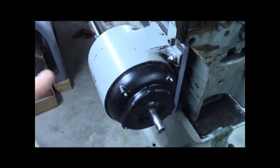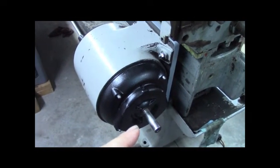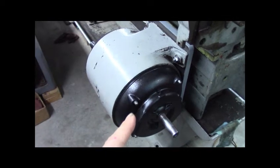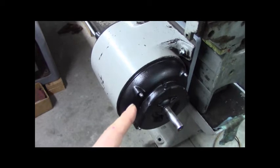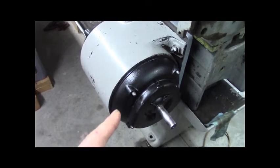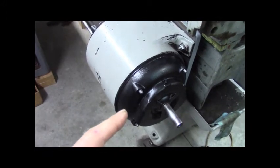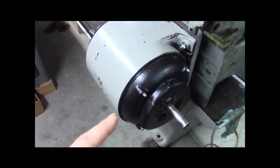What I did to that motor: getting that pulley off was the big one — that was two hours with the cutting torch heating it up. I cleaned the end bells, so much dirt and grease inside. I stripped the layer of gray paint right down to the primer using the needle scaler gun, then cleaned them meticulously down to the original primer and painted them black.